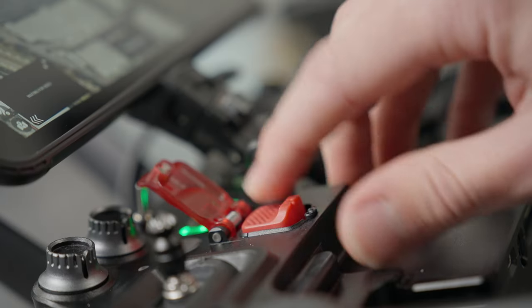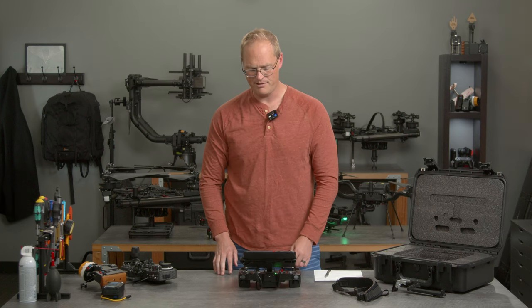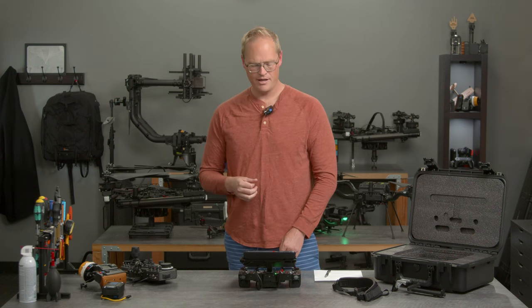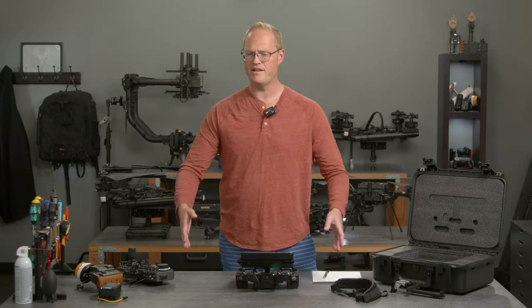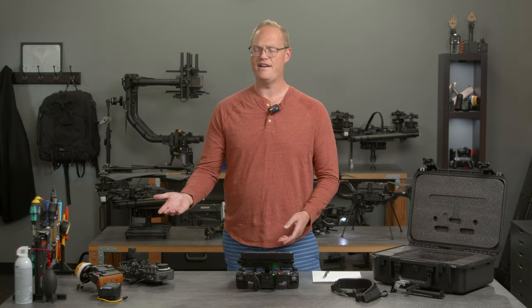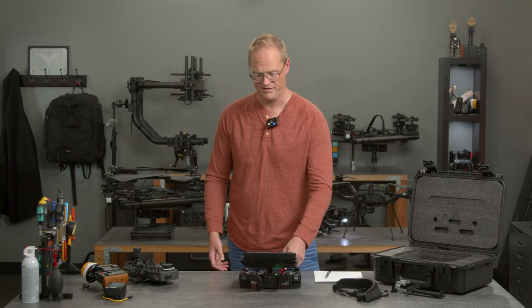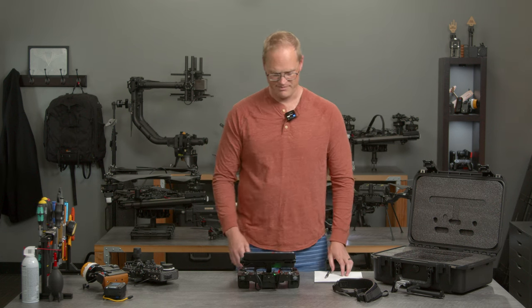This is my personal favorite — a safety cover kill switch. There are certain missions where I want the ability to disarm the drone instantly if something goes wrong. For example, say we're filming a SpaceX launch inside a bounded box we may not leave. If GPS gets jammed or spoofed and the drone starts going off course — maybe it's a novice pilot, they panic — you always have deterministic control of what happens to the drone. Dangerous things should have a kill switch. That's my point of view.